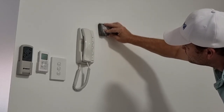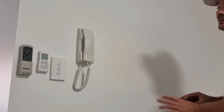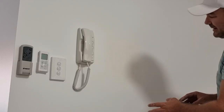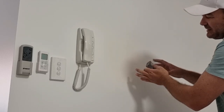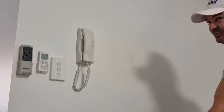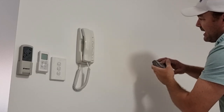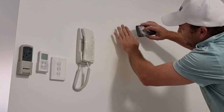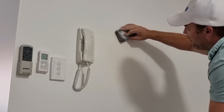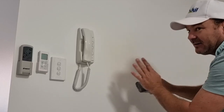It's very difficult to make it really straight, the same, and no edges. You can see I did it once and then I felt it, and I thought I need to do a bit more. It's easy to do more because you already have the body. So I went a bit bigger. And then the sanding is the important bit. I'm just sanding next to the old and the new, making sure that's blended well. You can't have any sudden steps.